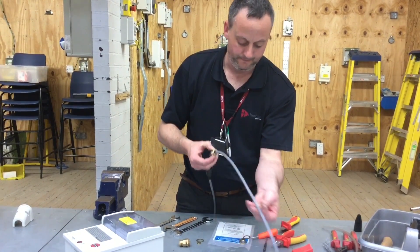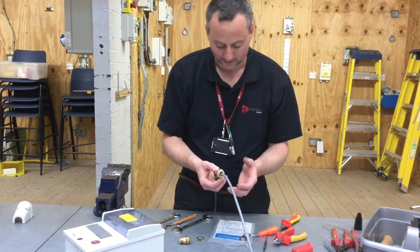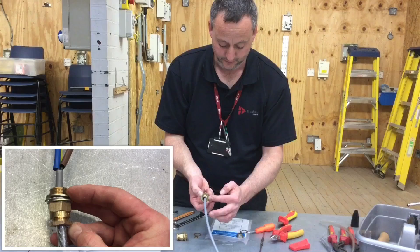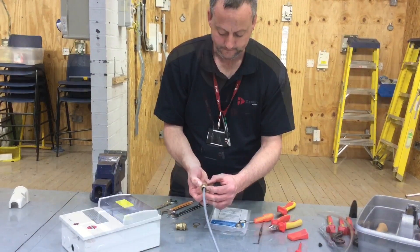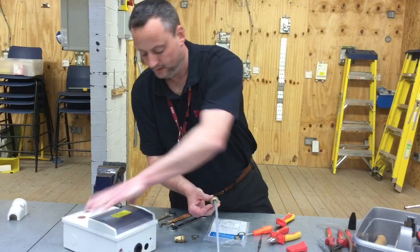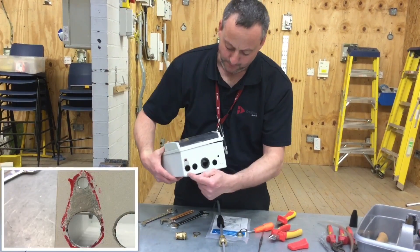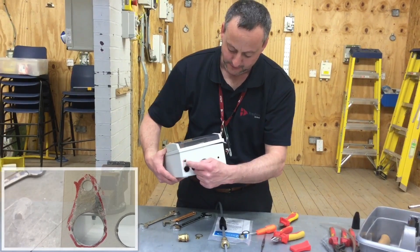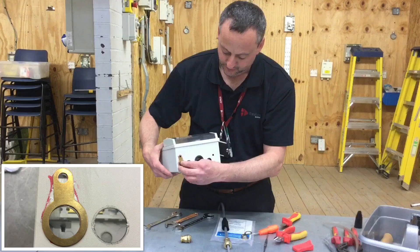We can now offer on the second washer. When we tighten this into position, the two washers will clamp against the braiding and make continuity to the braiding itself, giving it an earth. The enclosure has already been prepared — lots of people don't like it, but we want the best possible electrical connection, so the paint has been removed. That's highlighted with a red pen so you can see, and it facilitates the earthing ring being positioned on the outside.